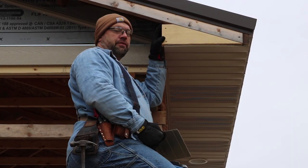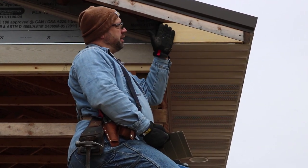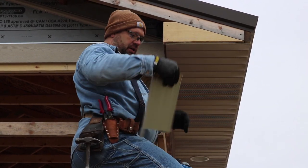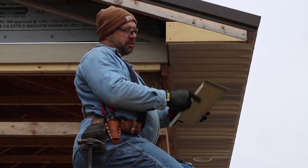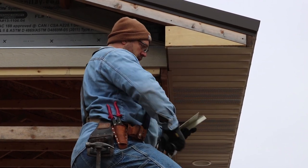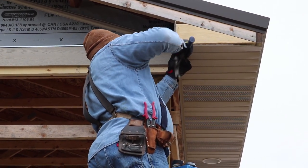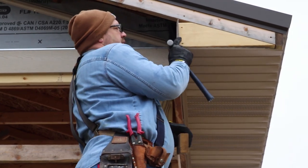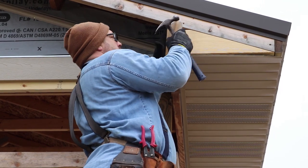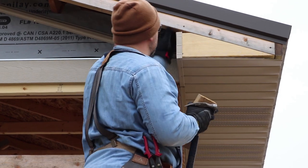The gable end is overhung a foot. So I extended this out, I framed this with a 2x8, I added this piece here to box it all in. Then I'll start on the back side with a little piece of fascia that I've notched with the 45 there. I'm going to fold over a little bit on this face. So I left this long about an inch, and I'm going to just pound it over. Like so.